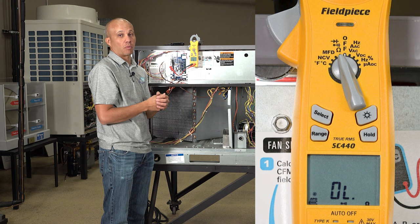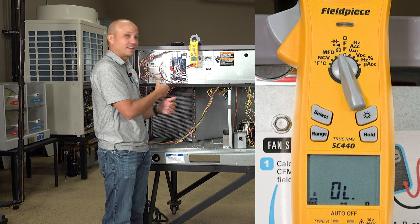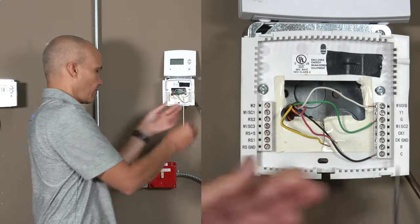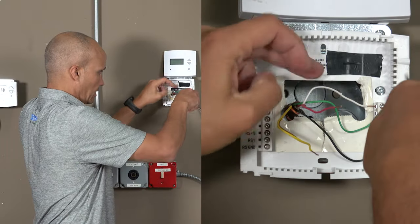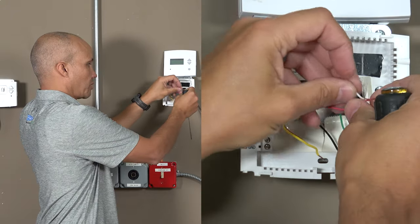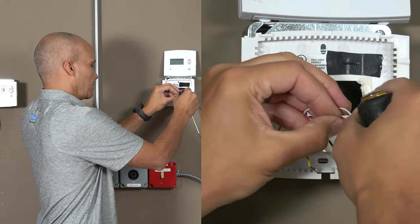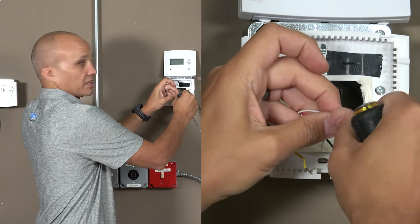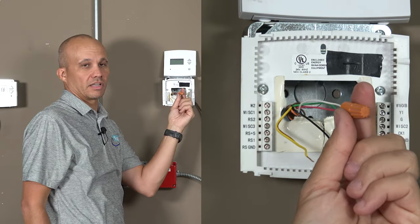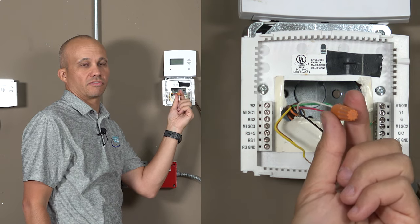In order to figure out which one's not working, we've got to switch it to something else. So we'll switch it to red and white and see what happens. I'm going to disconnect red from yellow and get the white wire out. We'll go white to red — once again, you can do any color combinations you want. You're just trying to find the one that doesn't play nice with everybody else. So now I've got white and red connected together in one continuous loop. Let's go back up on the rooftop with our meter and test to see if those two are okay.